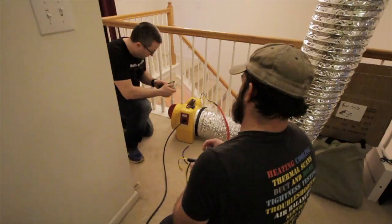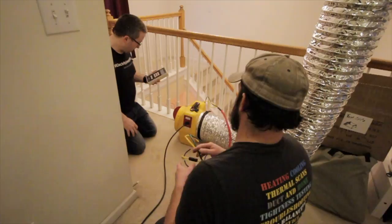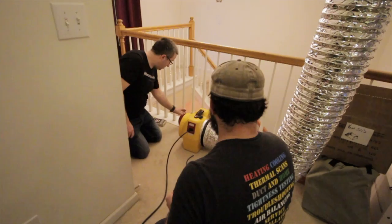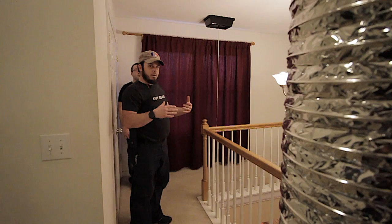It'll probably be the same hoses. Pressure flow at 25. It would be the same hose connections that you do normally. Mm-hmm. Just yeah, here. No communication wire. Yeah. Well, we'll try it. Okay. Once we get yours working, we'll just pull the hoses off of that and stick it on this. The same thing, we know we're probably right. Yeah. I'm really hopeful that this system works. We're going to be depressurizing the ductwork, or sucking all the air out, and measuring how much air comes in with the duct testing equipment.